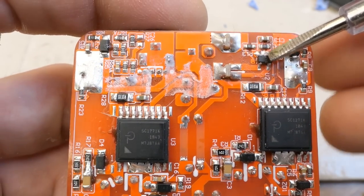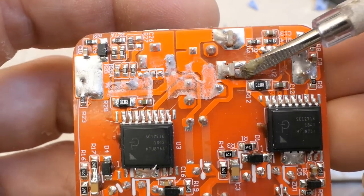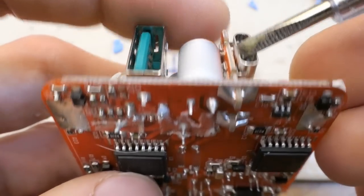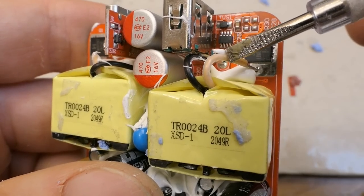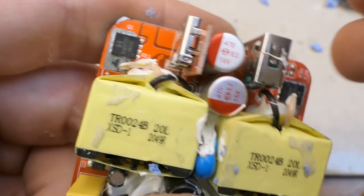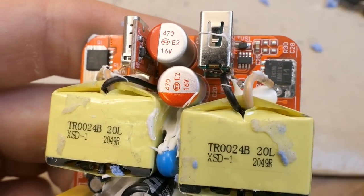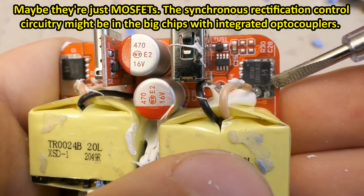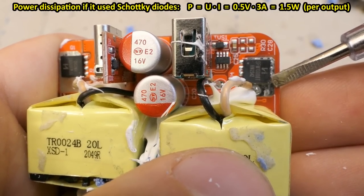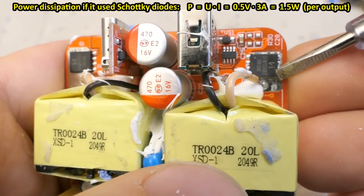The secondary side has a lot of pins on these chips. There are some diodes and maybe a chip for communicating with the device to negotiate the voltage - only one port has the Quick Charge feature. These other chips are probably synchronous rectifiers: one terminal of the secondary goes into this one, one into this one - synchronous rectifier chips containing synchronous rectifier MOSFETs and their control circuitry in one package. Synchronous rectifiers make sense because each port supplies up to 3 amps, and even a low-voltage-drop Schottky diode would drop about half a volt, dissipating around 1.5 watts at 3 amps - that's 3 watts total just for rectification, so it's much more efficient to use synchronous rectifiers.